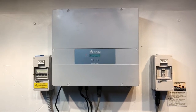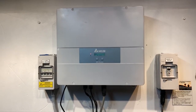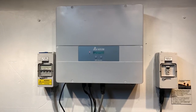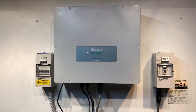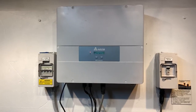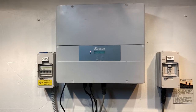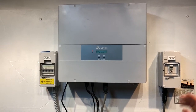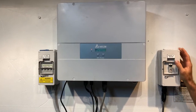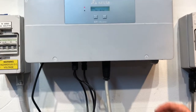There are a couple of things you want to check first: make sure your solar supply main switch in your switchboard is turned on. You also want to check that you're not experiencing a blackout at the time, because if you've got no power at all from the grid, it's going to be totally normal for it to come up with an issue like this. Also, if your inverter is not installed beside your switchboard, you should have an inverter AC isolator just like this one here, so you want to make sure that's in the on position as well.